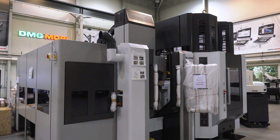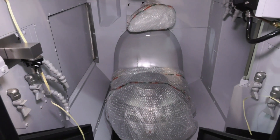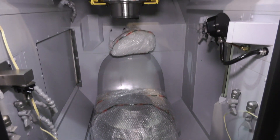They also have spindle face and taper on the clamping on the table. This machine is in its pre-delivery condition, but it has spindle face and taper which again provides more security when you're changing your pallets from part to part.